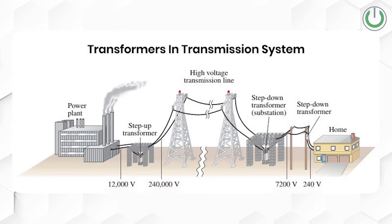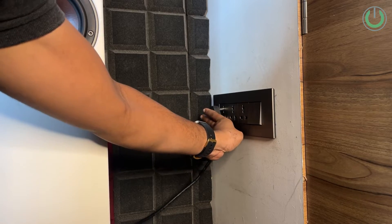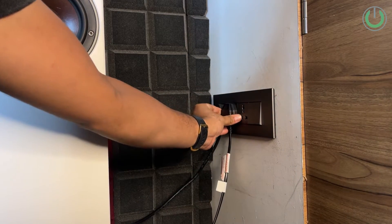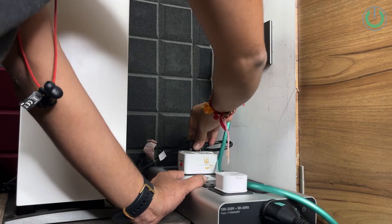The grid is located somewhere, power passes through transformers and many houses, and by the time it reaches your home, the many electrical and electronic devices in your home absorb current and cause distortions. When a home theatre system is connected to this supply, a lot of distortion occurs — and that is where the power conditioner's job is to condition the power signal and give you a much better output. We have done a comparison demo — same volume, same amplifier, same electronics — first connected to direct supply, then using the power conditioner. You can see for yourself how the system's performance totally changes. This improvement does not happen with a surge protector or UPS.